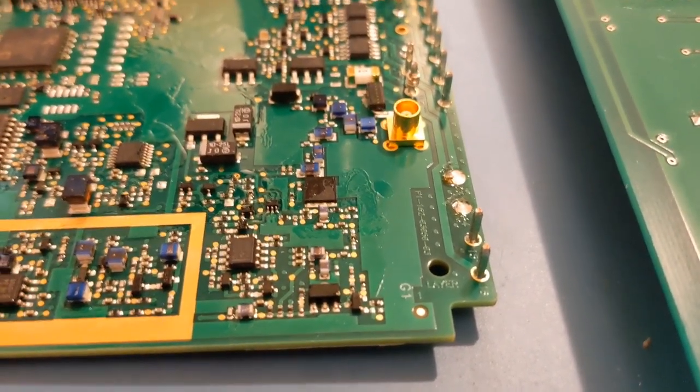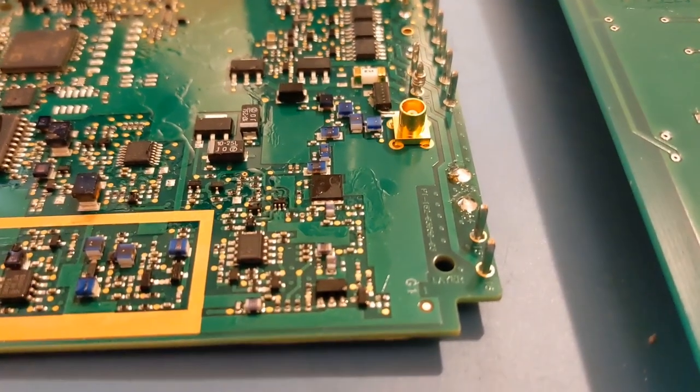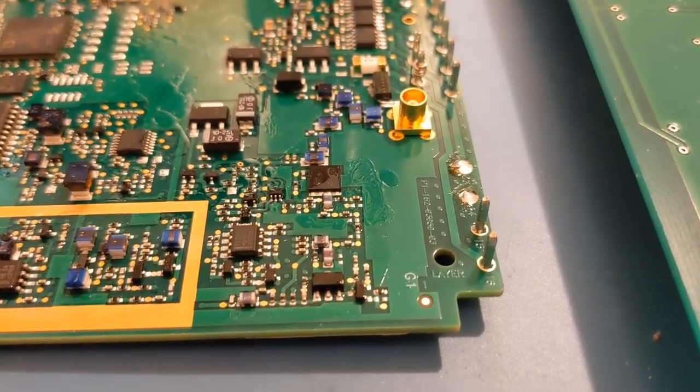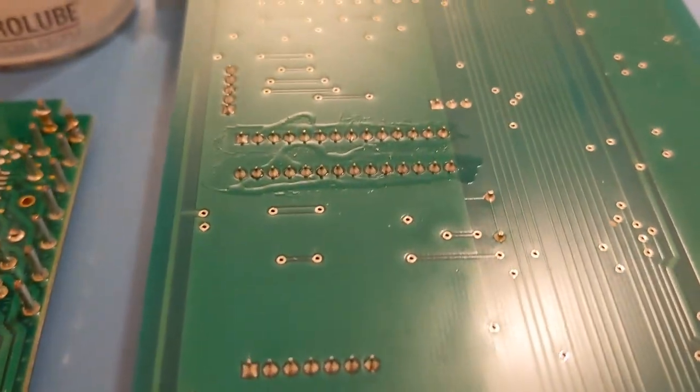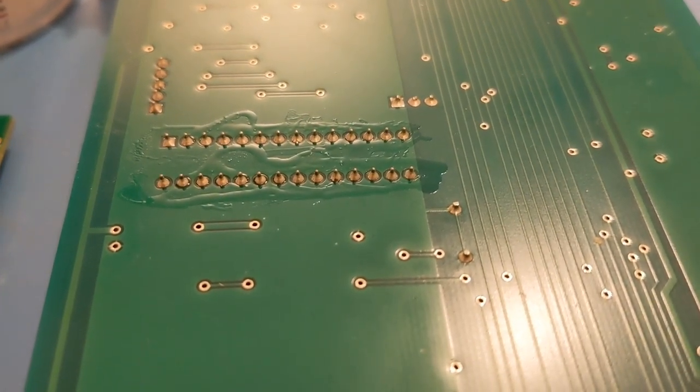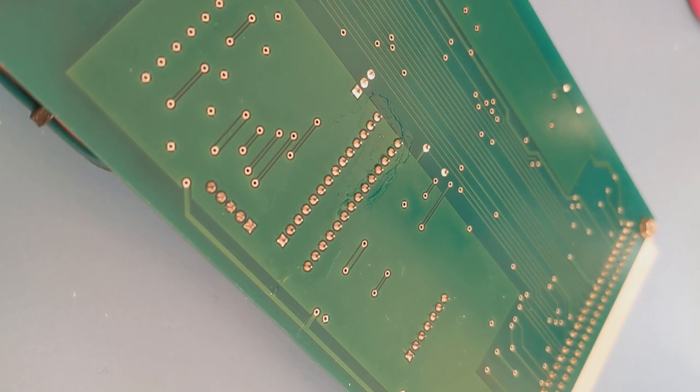So what I'm going to do first — I've got my G-Tech dry wipes and my Ultrasolve and the Fluxsoft. First I'm going to do an Ultrasolve with the dry wipes to wipe this one clean and get all that flux off that connector. Then we'll move on to the other. So coming to the first method: this is where I just use a dipped cloth in Ultrasolve. Ultrasolve comes in a few different varieties — you can get a 1 litre drum, a 5 litre one, a 25 litre one. You can also get an aerosol spray where the brush slots into the end, which is exactly the same style as the Fluxsoft one I'll use later.